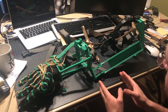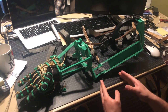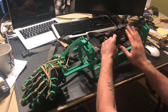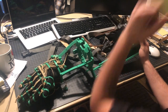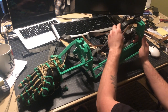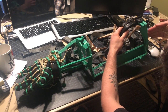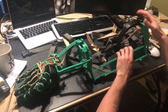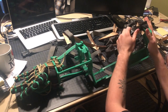If you look in here — this is where the shoulder would go. This design is going to change, but for now: this is the shoulder joint and there are actually three different movements on it — up and down, in and out, and abduction/adduction. Your arm comes through here, and this lines up with the shoulder joint. These axes are all at 90 degrees to each other, allowing abduction/adduction at this joint and internal/external rotation of the arm at this joint.